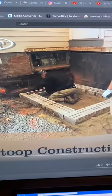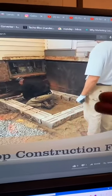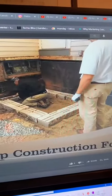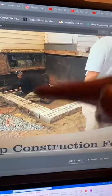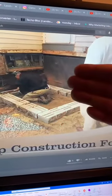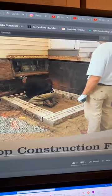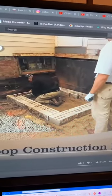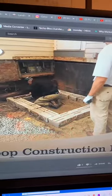The second thing is you don't want to apply additional load up against that foundation wall because that additional load creates a situation of unbalanced fill. What that means is on the other side of that foundation wall is nothing. And now you're building all this extra weight, all this extra load up in this area. So that pressure going up against the foundation wall with no reinforcement on the other side could cause cracks in the foundation, of which you would be liable because you're the builder who put that new structure in and you attached it to the house.